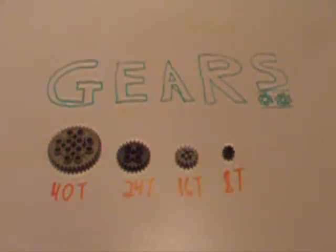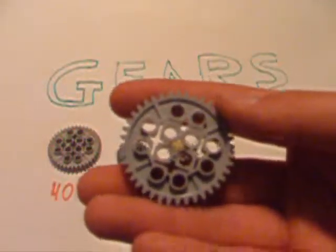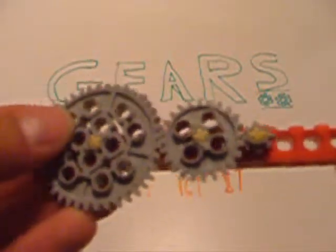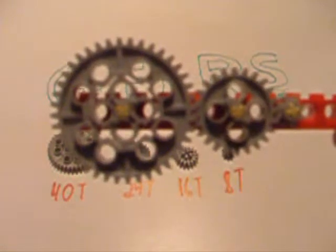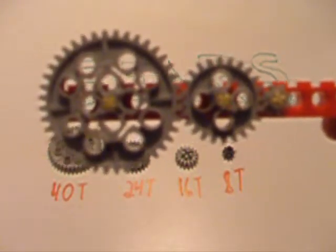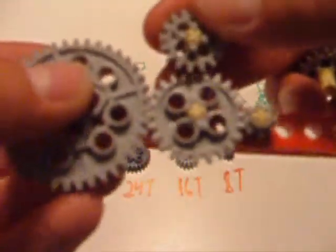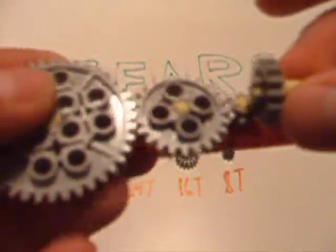As we saw in the previous episode, the first class of gears are straight-tooth gears. As you notice, every straight-tooth gear has spikes — the teeth of the gear — which protrude out straight from the gear, thus a straight-tooth gear. Straight-tooth gears are designed to pass motion laterally. In other words, if you set straight-tooth gears next to one another, they will rotate one another. Straight-tooth gears can only pass motion on a two-dimensional plane — although they can pass motion upwards and sideways, they can't pass motion at an angle.